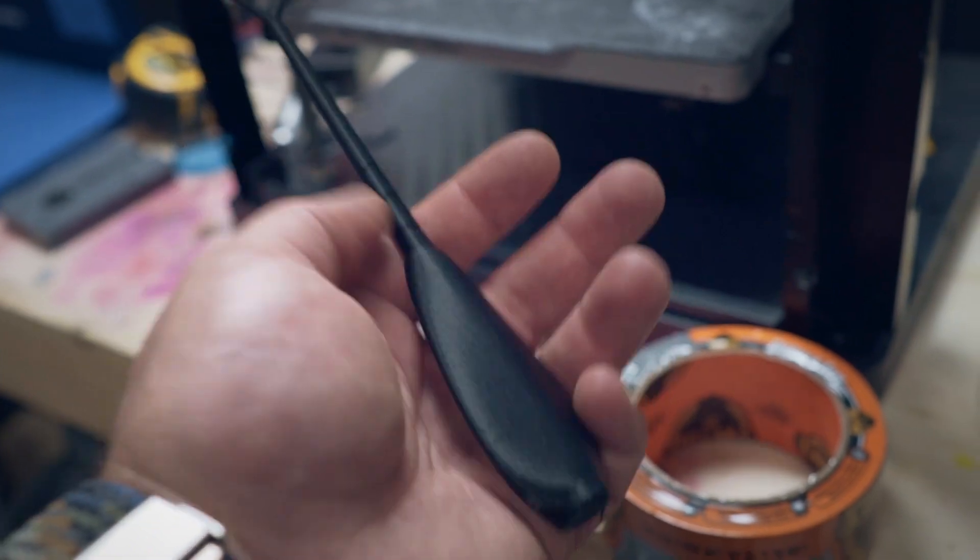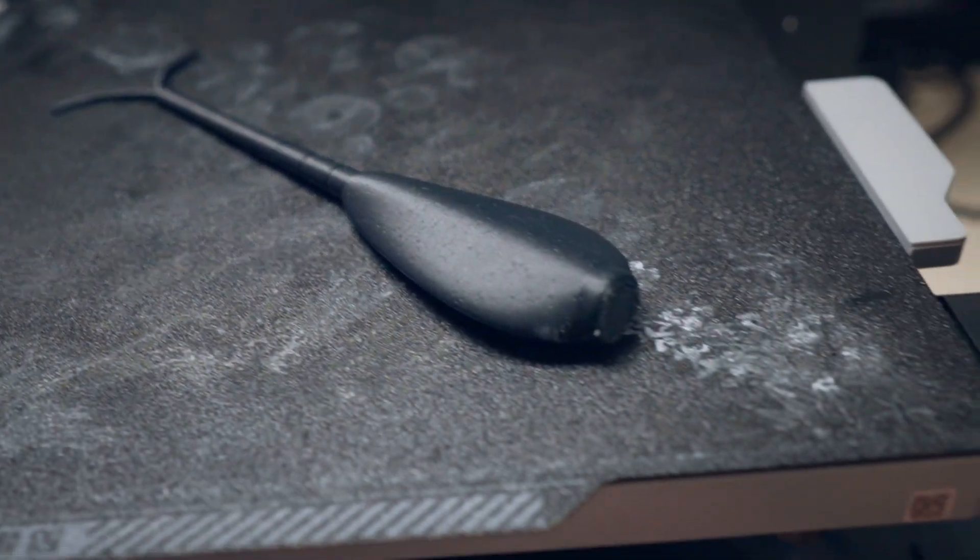The next step is really the first prototype, and there are two ways to do this. If I'm making a style of lure I've never made before — say a creature bait for the first time — it's helpful to print out the bait itself, the master, just to hold it in your hand and look at it. I have a hard time visualizing in the computer how big it is, where it sits on the hook, how it looks. You can use a resin printer or an FDM printer for this. I've been using my FDM printer — my Bambu Labs P1P — because it's wicked fast, so you can knock these out quickly and get a feel like 'this head part seems way too big for the hook.' Then you go back and adjust those parameters for rapid modifications.